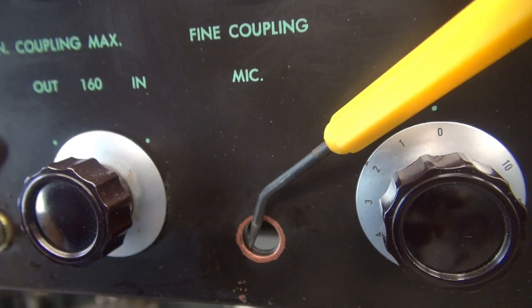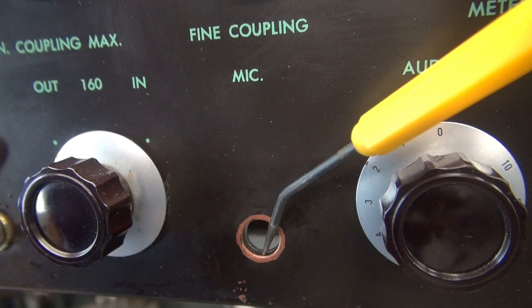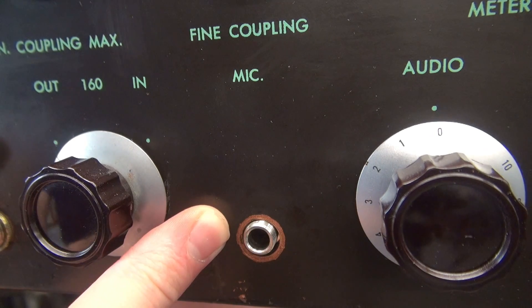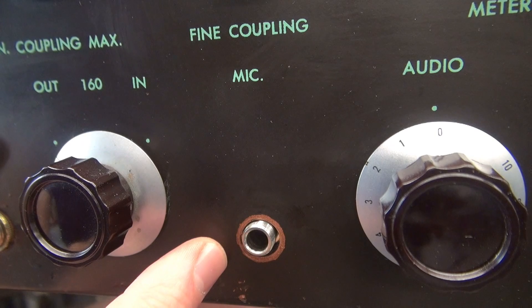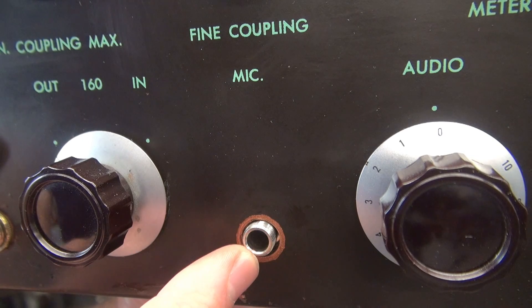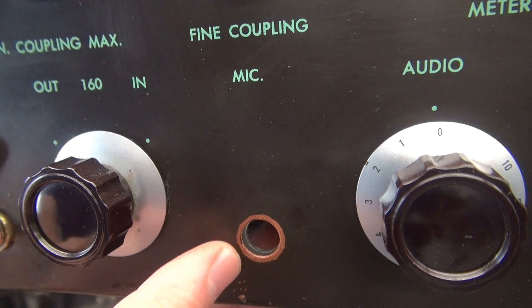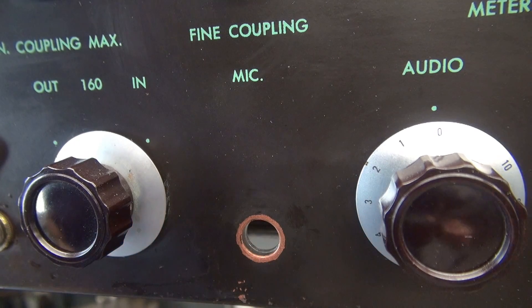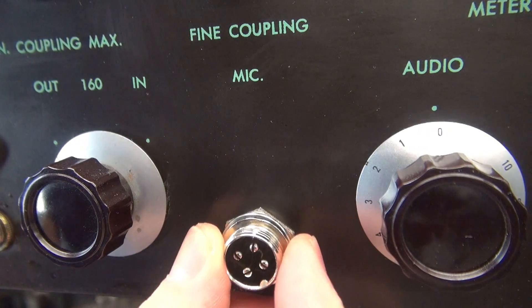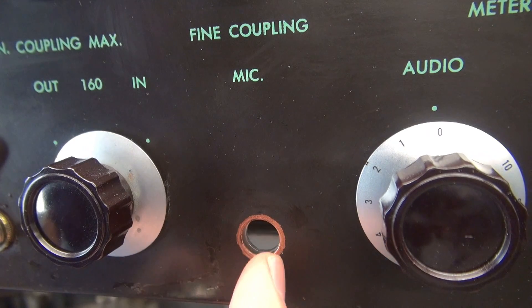Between the chassis and the front panel there's a gap - a little over an eighth of an inch. You may find that when you install that TRS jack, you might not be able to tighten it because this metal plate is going to try to pull into the chassis. I've seen guys actually bow in their front panels and damage them by over-tightening this nut. Just something to be aware of. Now, the person that owns this radio wants the four-pin jack, and diameter-wise it ain't going to make it, so we're going to have to drill this out.